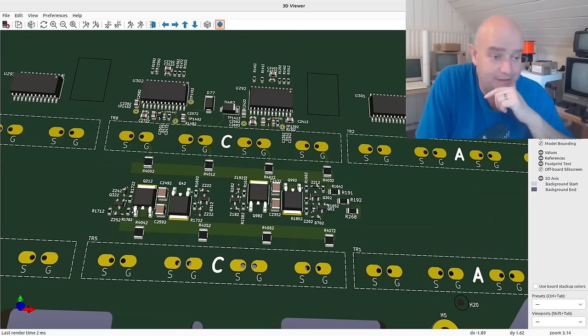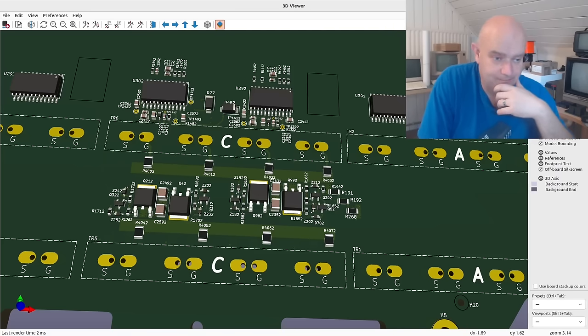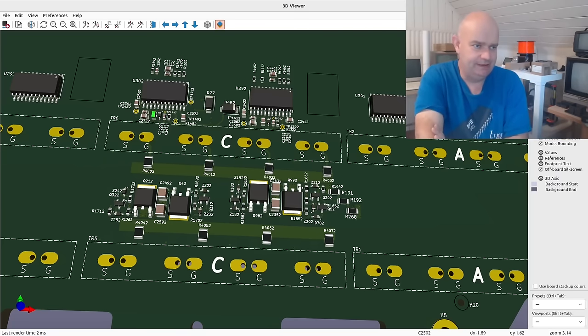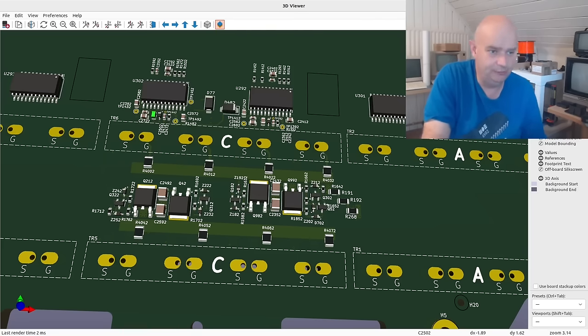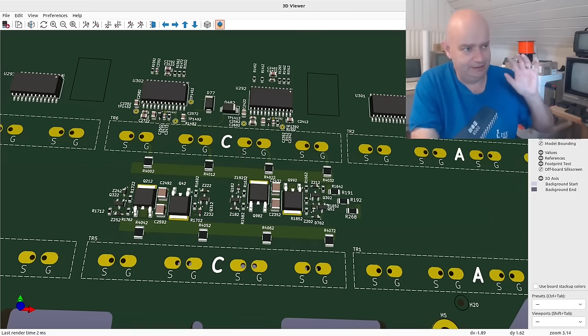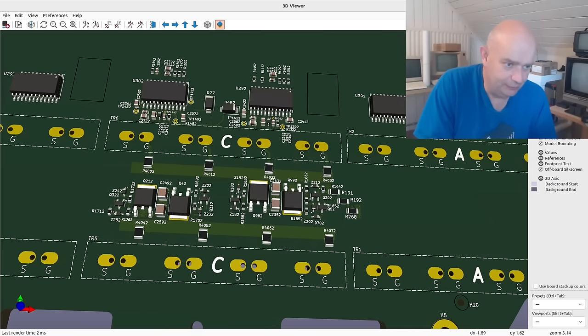This part here in the middle has now filled out with all of these parts. The biggest things you're going to see are the gate resistors, the push-pull transistors, and a lot of the little control parts. How this has been done is that each component's reference is the same as on the Model 3 logic board, and the positioning of the part is going to be pretty much exactly the same. The positioning of vias, test points — all of that will be basically reproduced from the Tesla board.